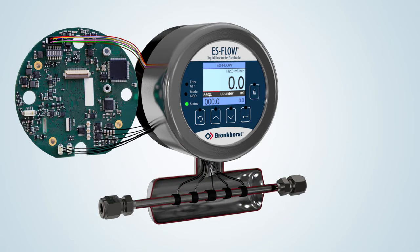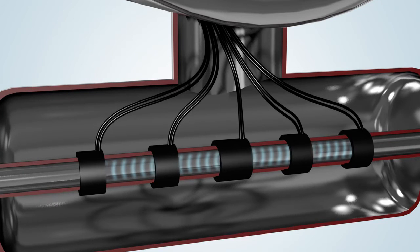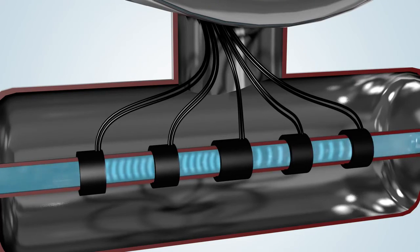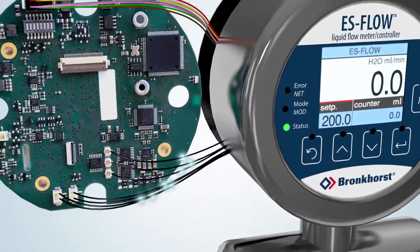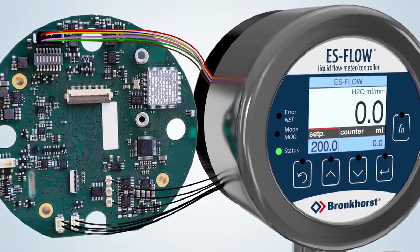Measuring is done in a straight stainless steel tube with a very small inner diameter. At the outer surface of the sensor tube, multiple transducer disks are located, which create ultrasonic waves by radial oscillation. Every transducer can send and receive these high-frequency waves. Therefore, all up- and downstream combinations are recorded and processed. By using the determined speed of sound and the calculated flow velocity in combination with the exact cross-section of the tube, the S-Flow is able to measure volume flow.